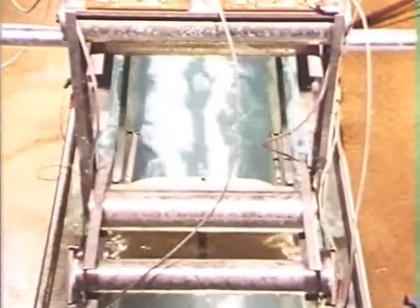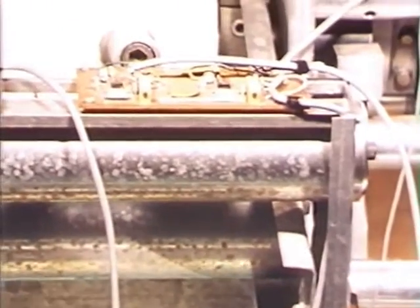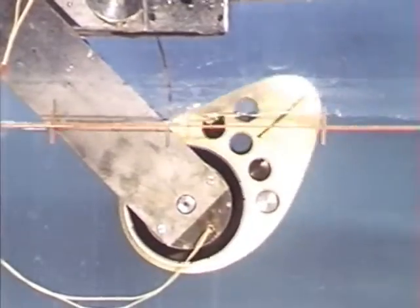That's a view from above the duck. The pitch-heave-surge rig is made of plates and spacers with very fat tubes with very thin walls, giving it all the rigidity you want. You can see some of the inside linkages covered with spray from ancient freak wave tests. Some strain gauge conditioning at the top.